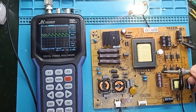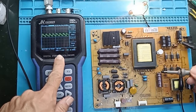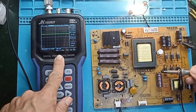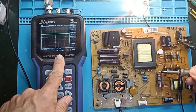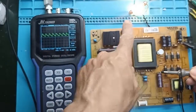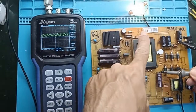I will show it again here. You see it without the capacitor — you can see the ripple that is created. It is also related to the frequency of the switching supply. With the capacitor, without the capacitor, and with the capacitor — you see the intensity changing in the bulb. So when at the output of a power supply we see this sawtooth ripple with our oscilloscope, we can say that something is not right with the capacitors, and then it needs a capacitor replacement.